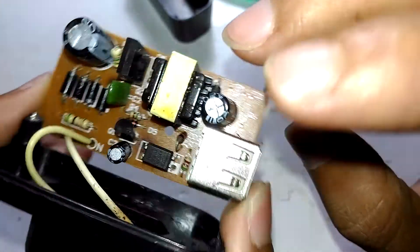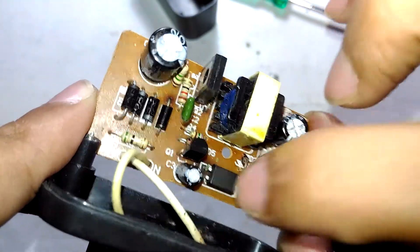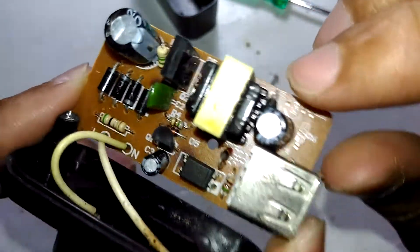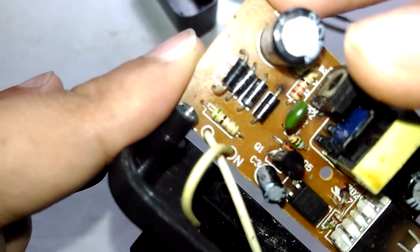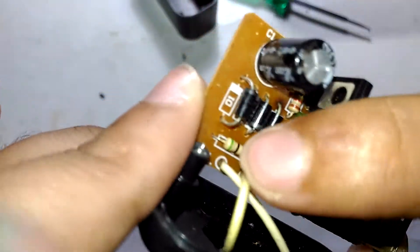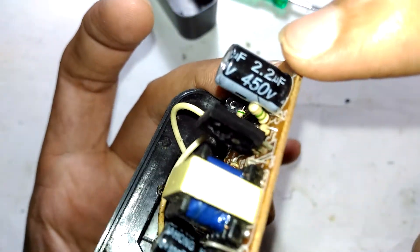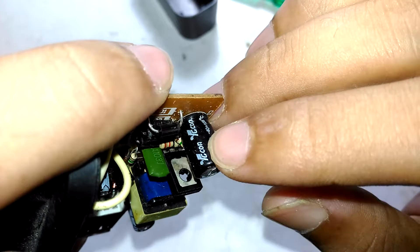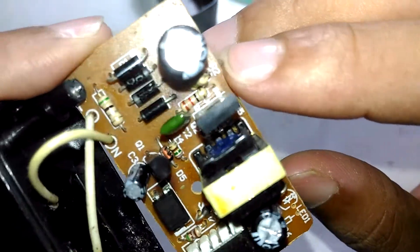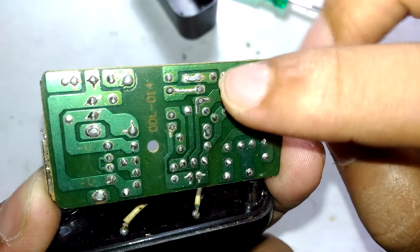The circuit is really simple — they're using NEC-branded optocouplers and opto-based feedback with a Zener diode that triggers the LED inside the optocoupler. The input goes in through a 1.5-ohm current-limiting resistor, straight to a bridge rectifier made of four diodes, then to a 2.2µF 450V capacitor made by a company called Taicon or similar, and then straight to the transformer core.